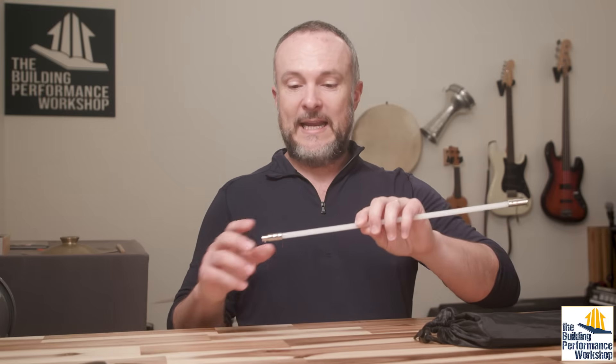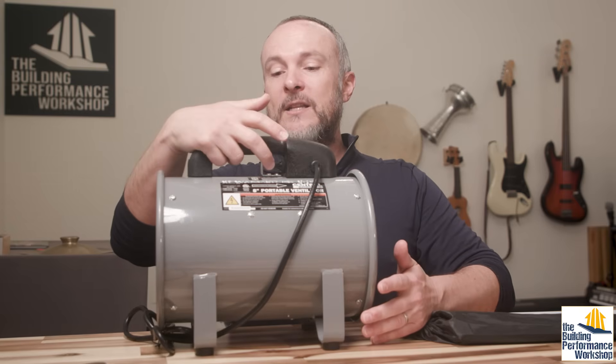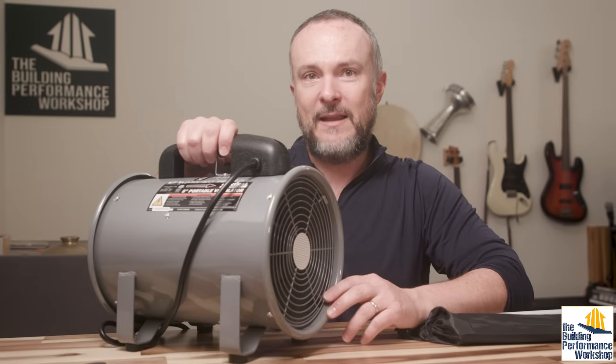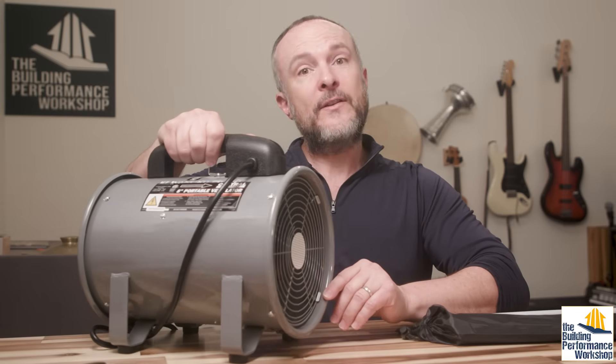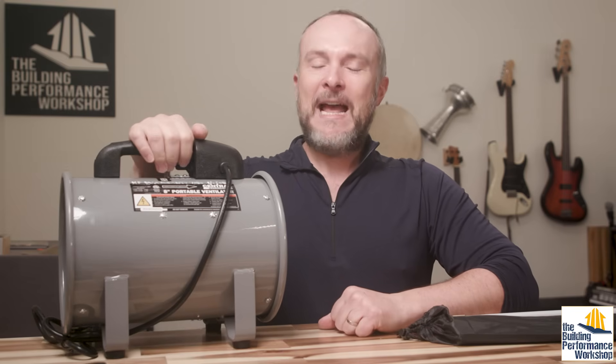I looked into chimney sweeps too, but chimney brushes are hard metal and will scar the inside of your steel duct. You definitely can't use them on flex duct because it would just rip it apart. So I came back to this: using the dryer kit for $20 and this negative air machine from Harbor Freight for $89. It's got two speeds — low speed is 1,380 CFM and high speed is 1,590 CFM. That's a lot, and I'm going to pull all the dust through this. Now you might think that fan isn't made to have dust go through it — and you're right — but at checkout they offered the extended warranty that covers anything, so I went ahead and took advantage of that.